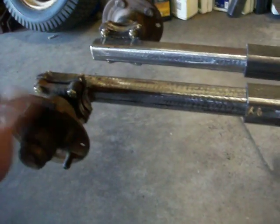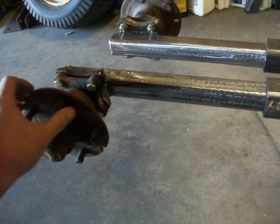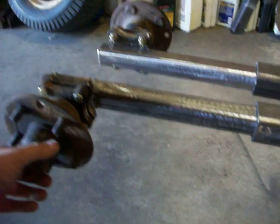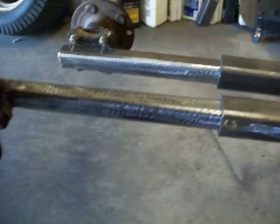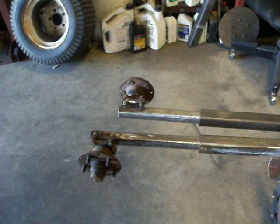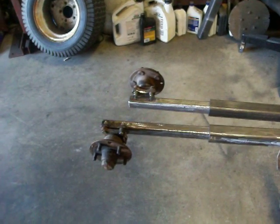In other words, once I get the tracks on and in place, I'll loosen or tighten the spring — whichever way I make it, I haven't decided yet — and that will put tension on the tracks and keep them tight. Even if the tracks loosen up or the hinges wear and the track lengthens, the spring will push it out and keep it tight.